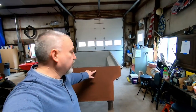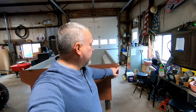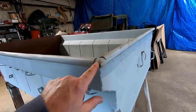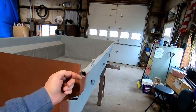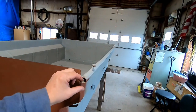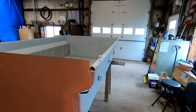Now I'm going to try to recreate this tube frame rail across the back end. I don't have a lot of experience with this, so this is going to be technical for me. I'm going to try to recreate the 90-degree angle here — closed. I'll show you from one of the other corners so you can see how this rail is closed in at a 90-degree turn. To do that, I need to cut a piece off my new pipe and weld it on here so I can make that 45-degree cut, then do the same on the tube going across the back so they come out and meet up at 45s and are enclosed like that.